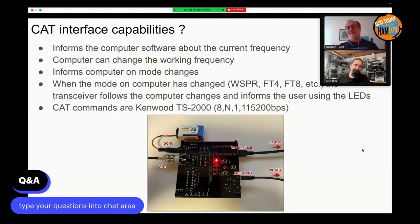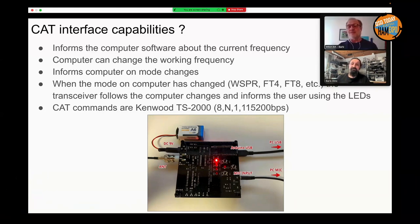I'm making that joke in other presentations I did. Basically, up to here, we create a glorious 30 megahertz switching supply. Until it goes into the LPF, in reality, it's a good noise source, but after the LPF, it becomes a transmitter. A transmittable signal.